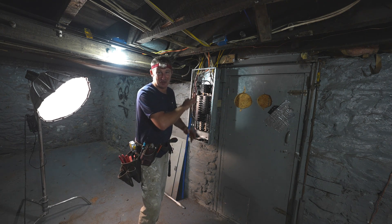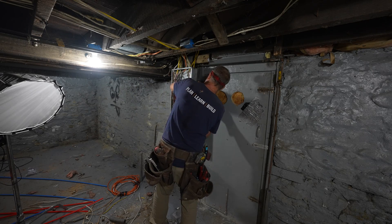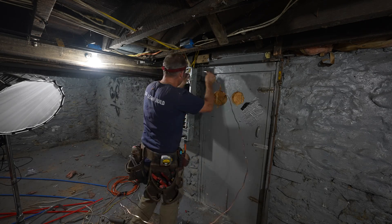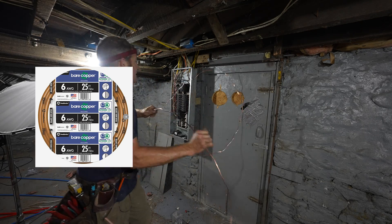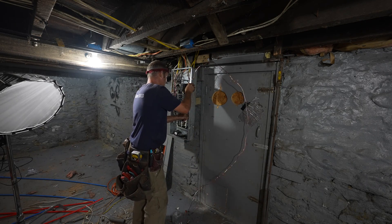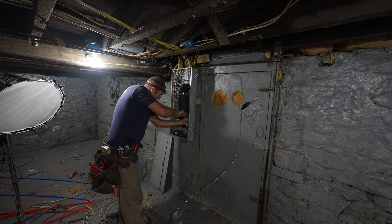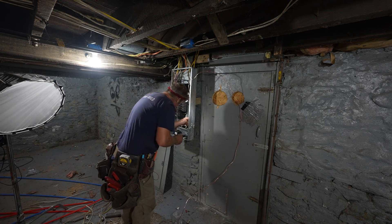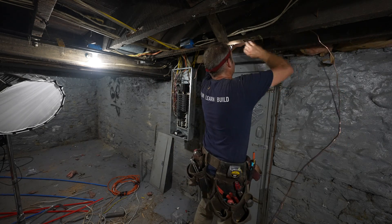I'll show you real quickly how we go about doing that — it's a really quick, simple process. It's a pretty simple installation. I use number six gauge wire for this, and most panels have a knockout specifically to run that ground wire. Just find an empty spot in your neutral ground bus and then staple this all the way around to where you can get to your meter.